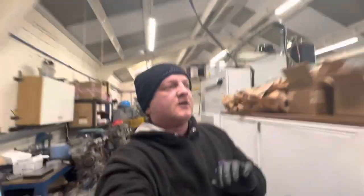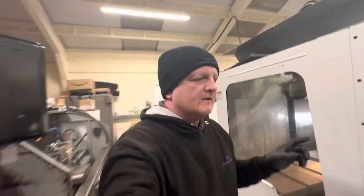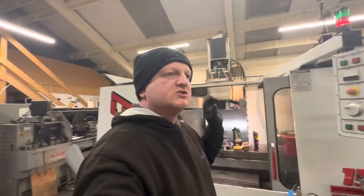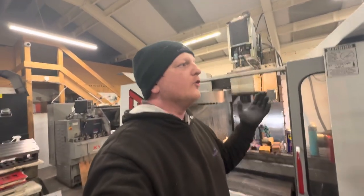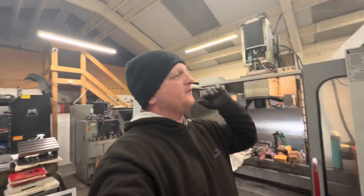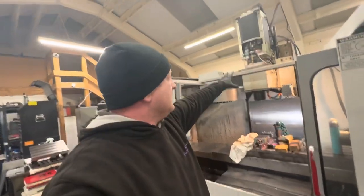so that straight off the cuff, I know that spindle, because I don't know how long that's not been run for. I know I looked at that machine about 6 months ago, and I know they've had it sitting there for about 6 months. So I'm guessing this spindle was not turned under its own steam properly with oil feeding to it for probably a year. So the last thing I want to do is go, yeah, it works perfect, straight in, 6,000 RPM, et cetera. And also, I want to check it.